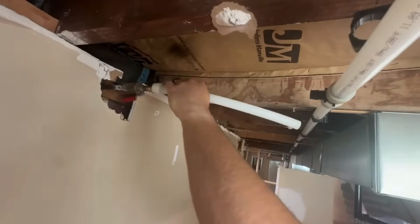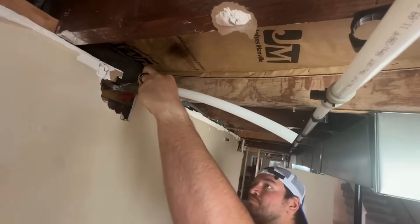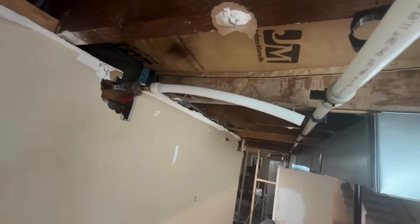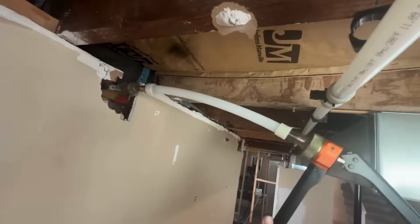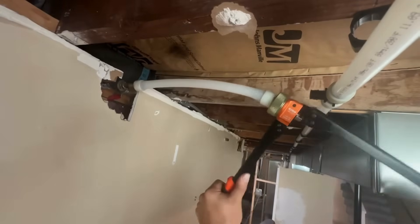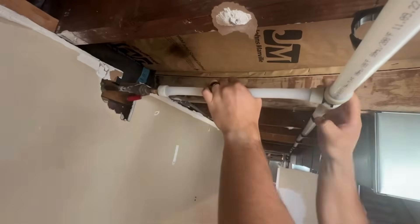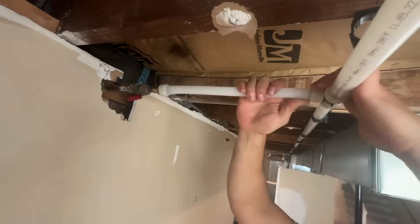Let's finish this up by adding the three quarter. Press that guy on. Now the DeWalt is easier because you just push a button, but it's three or four times the price. This is perfect for your homeowner at $135. You don't have to worry about soldering — anybody could do plumbing with this thing. Put the coupling on, expand it, stick the tube on, good to go.